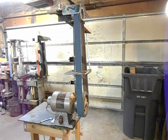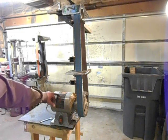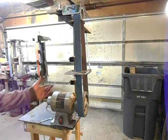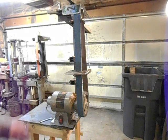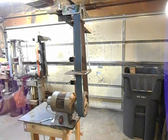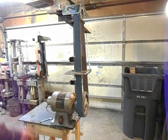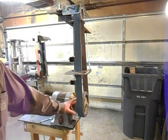Basically you've got a motor — this is a one-and-a-half horsepower, 120 volt, 1750 RPM hard wheel grinder. I picked it up with a stand at one of the local pawn shops for about $80. The hard wheels that were on it were way out of balance, so it ran horribly at the pawn shop, which is why I got it for a pretty good deal. I knew I wasn't going to be running it as a hard wheel grinder anyway.